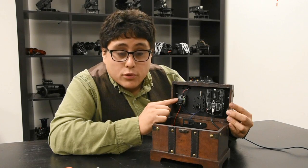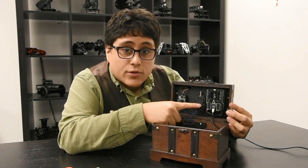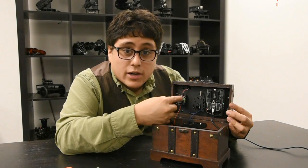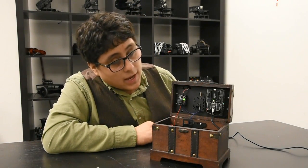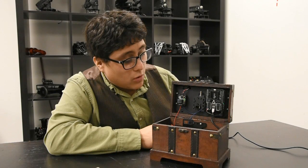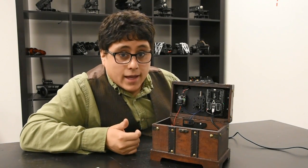You can think of the relay as a bridge. You don't want to control the solenoid straight from the Geek Duino because the Geek Duino doesn't have enough power to control the solenoid, so the relay acts like an electronic switch, allowing the Geek Duino to turn the solenoid on and off. As you can see, whenever I swipe my tag, the green light on the relay will go on, and that coincides with the solenoid coming out.